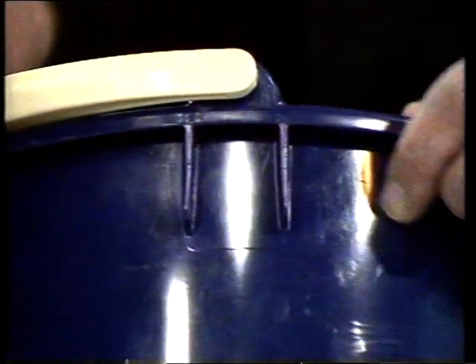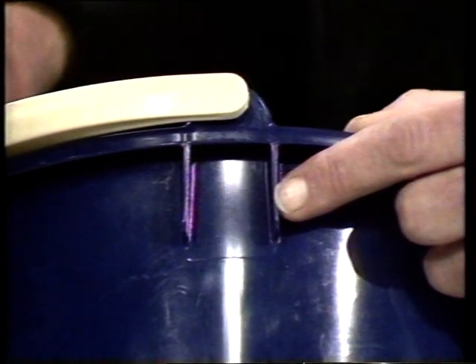You could have a thick, solid rim instead of an arch shape. That would use more material and be a waste, as well as making the bucket more expensive. And here the rim is reinforced with struts like these to support the handle. Have a look at the handle — cut through, it's a capital I shape, a very strong shape, and again, not wasting material.